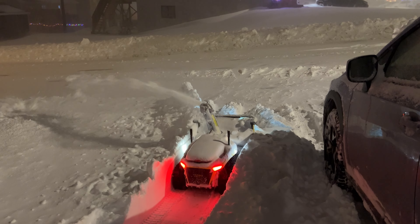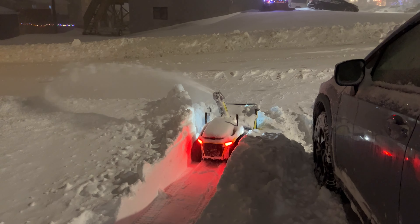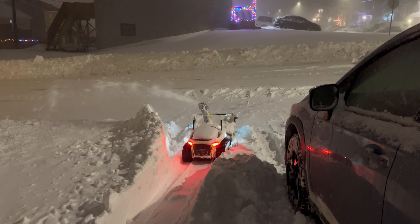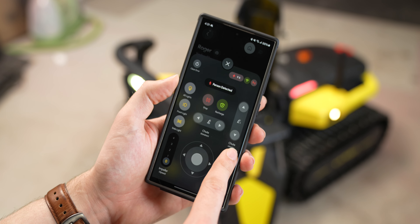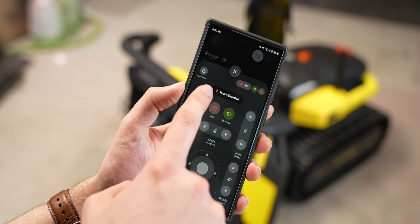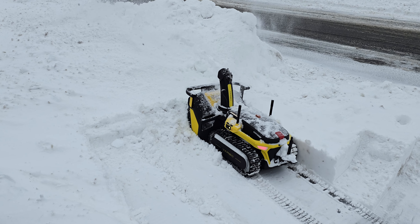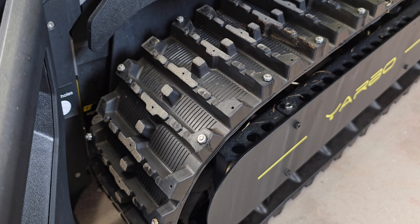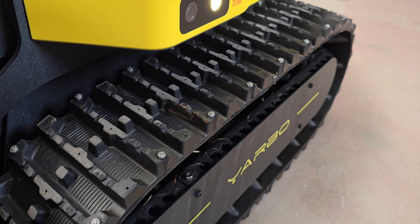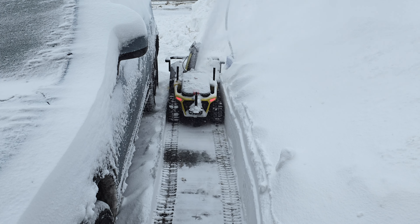So how good is this autonomous electric snowblower anyway? Well, much to my surprise, it is shockingly good at moving snow. In manual mode, controlling it via the app or with the physical controller, it can plow through snow that's taller than the snowblower itself. There are a lot of controls, but once you get the hang of it, it's pretty easy to use — buttons for moving the snowblower module up and down, changing the direction or angle of the chute, turning the lights on and off, and changing the auger speed. Yes, there were times the Yarbo got stuck and the tank treads were just spinning, but it was easy enough to get it unstuck by raising the snowblower module and driving backwards. There are also little metal studs that screw into the tank tracks for more traction on icy surfaces, and those were almost essential here — they made a huge difference.